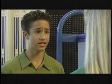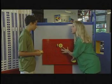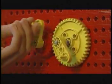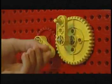What happens when you put two gears together that aren't the same size? Let's see. Notice that the follower gear is two times larger, and it has twice as many teeth as the driving gear. Give it a try. The follower only rotates half as much as the driver. That's right. It has half the rotational speed of the driver.